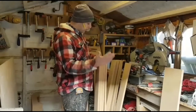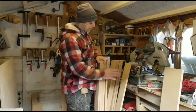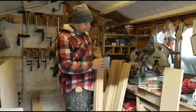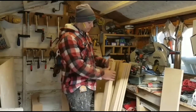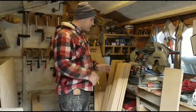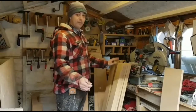Just a little tip - well, bit of common sense really. What I normally do is I mark them, because with quite a lot of parts to it I get confused. So I put 'Tracy' and 'F' on there - that's Tracy and that's the front rail, style sorry - so that's Tracy front. And this one I've got Tracy and Rail on, so I know these are the top and bottom rails and these have got returns on the other side. Just give them a little mark and then you won't get confused what size is what, because sometimes they are the same dimension as the rails and it just gets a bit confusing.